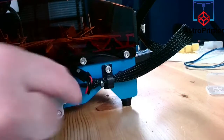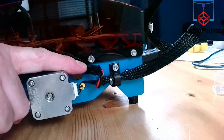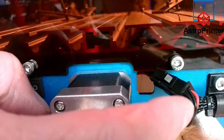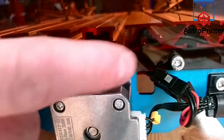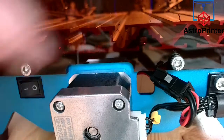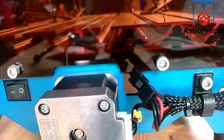This connector is square, and this is key. So there's a clip on this side to lock over this grommet right here. And what was happening is, let me get closer, you might be able to see it better. This clip should lock over this piece here. And what was happening was the wires were not lined up correctly. When I did a closer inspection, I noticed the wire colors didn't match up, so I took the connector off, turned it 90 degrees counterclockwise, replugged it all in, so the black wires lined up and the red wires lined up on the other side, and that solved the problem. So the issue went away after that.